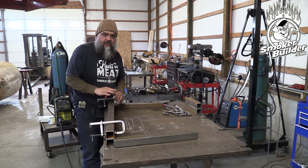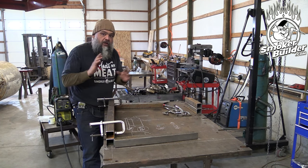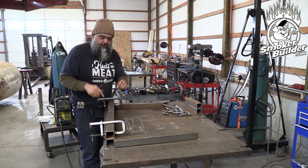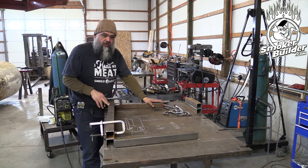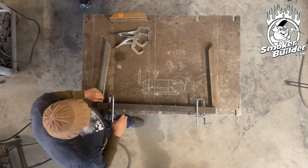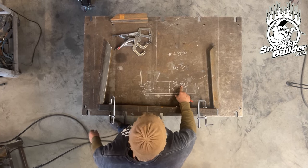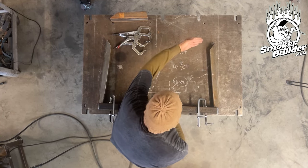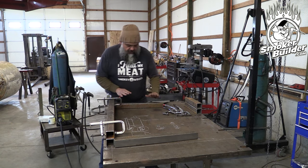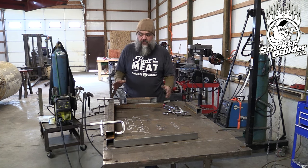Here we are with the legs. We're getting ready to make the smaller of the three legs that's going to fit underneath the firebox. All the cross members on all of these leg assemblies are going to be the same because they're fitting between the same two parallel rails front to back of the cooker. So we can use our initial assembly as a template or a pattern, and build right off of that. We measured out the difference between the firebox and the cook chamber at 10 and 7 eighths, drew that down, mimicked our radius, and that generated our new cope line for the leg. We marked that out on a solid piece of two inch, made those cuts, and we're just going to lay those right on top of our existing frame.